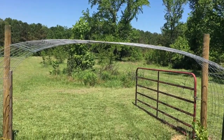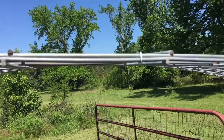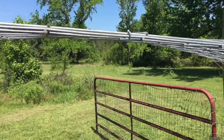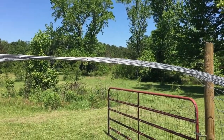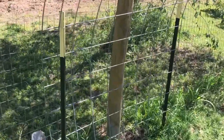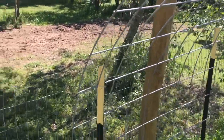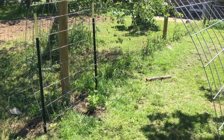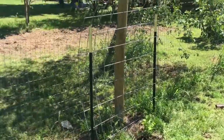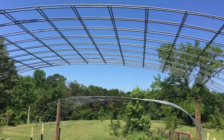Here's the first one — it actually ended up sitting lower or flatter than I'd hoped for. You can see I've got these things hog-ringed in here; I'm going to grab a screwdriver and undo these hog rings and hike that up a little bit. Here is kind of how we're fastening them in just so you can see what we're doing — we're coming over a T-post, tying it on with some fence wire, and stretching across. This is the first half of the second one, and we're going to get that one put up real quick.